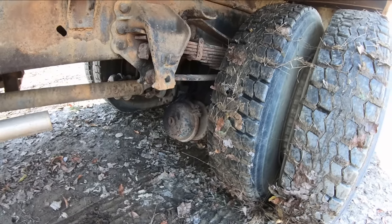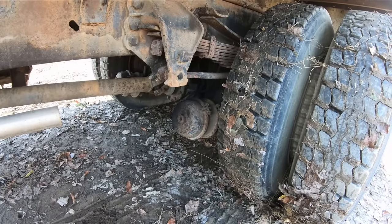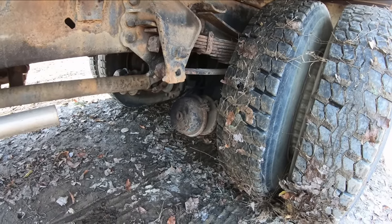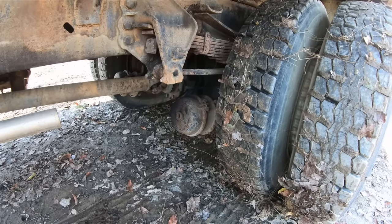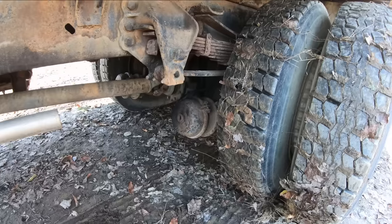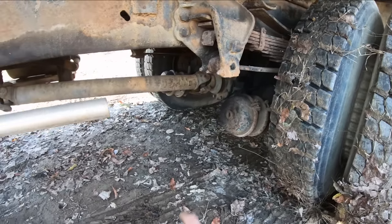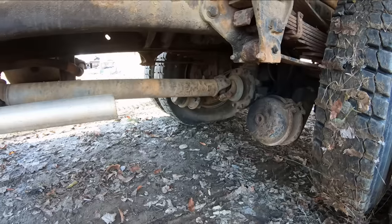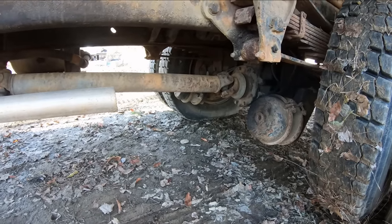When you push that yellow knob on the dash, it fills that rear chamber and releases the park brake side, and that's obviously the side we have a hole in, because when we push that, now we're just blowing air out of there. So that thing's got to have a crack or a hole in the diaphragm. I see we've got a flat dual on that side in there, and it looks like a gouge in the sidewall, so that tire might be junk. Hopefully not.